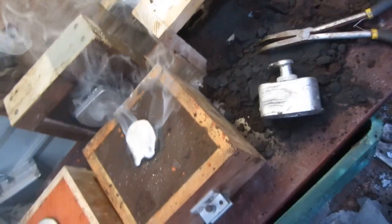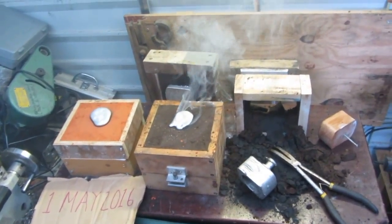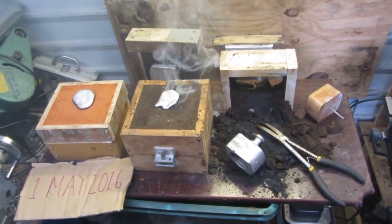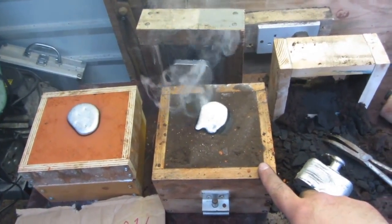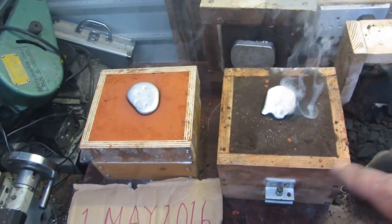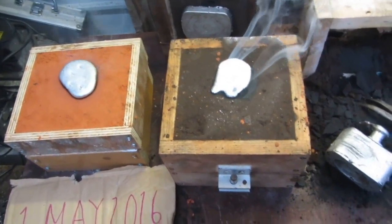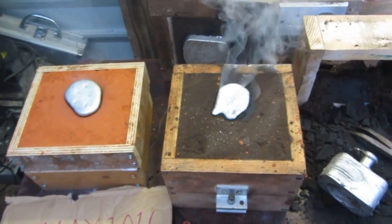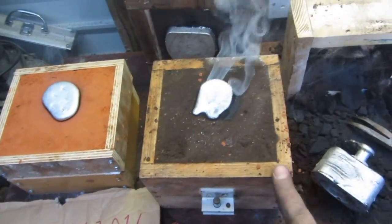This is just a fun project. I've enjoyed doing it today and I just thought I'd make a quick video. Before it was a disaster — I had run out of material and I could only do two moulds at a time. So this mould here I rebuilt again because I didn't want to do it all over again, just by adding some fresh sand, pressing and ramming it together, then taking my pattern back out again. I put my pattern in first before I rammed the sand around it to repair this mould. So this is sorted.